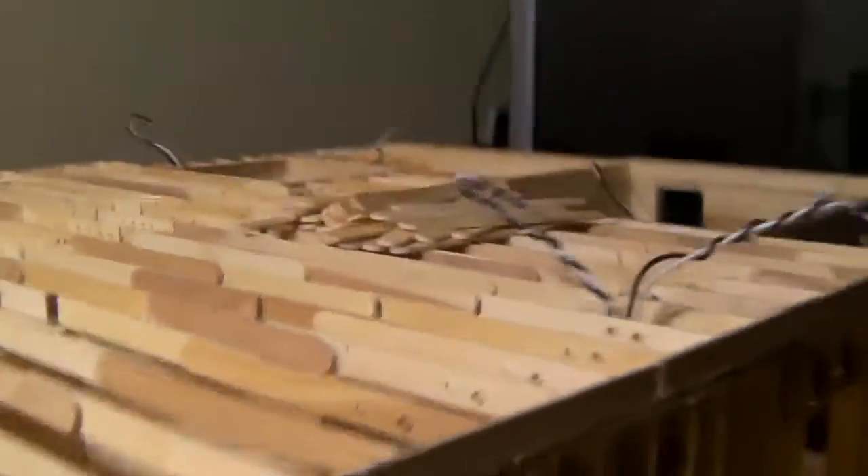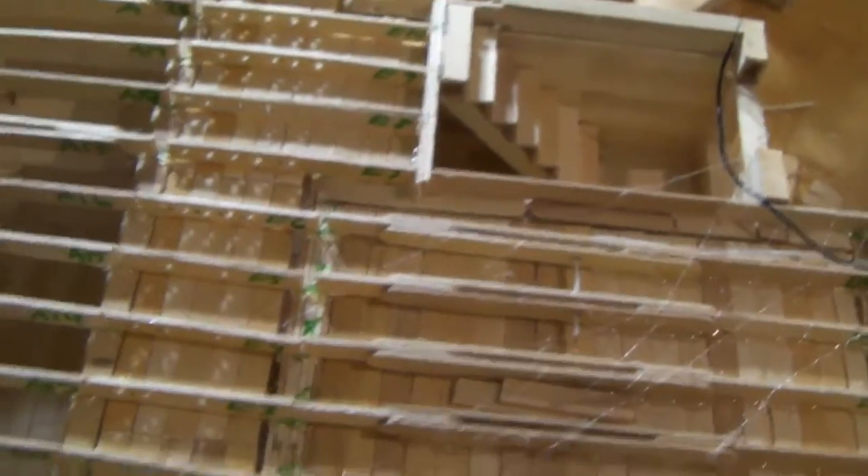You can see I did some of the ceiling. The joists are all one inch apart — very nice and flat. The floor will be nice and flat when I put the top on. But before I put the top layer on, I need to put the ceiling on underneath so I can reach my hand under there. I did quite a bit of that already. It's not the neatest job, but most people don't even see that. The only way you can see the ceiling is if you look down like this, so it doesn't have to be perfect. There's a gap here, but this will all be dark so light won't shine through.